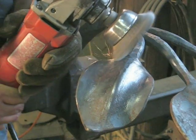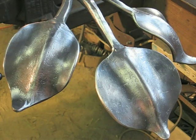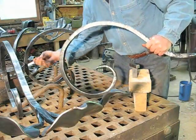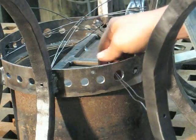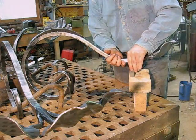The thing that is the most important of all is doing this wire wheel brushing, because what we're doing is removing all of the oxide scale that has been formed during the forging operations. That has to be removed — otherwise you're not going to get a really pretty finish, and I'll tell you more about the finishing later on.